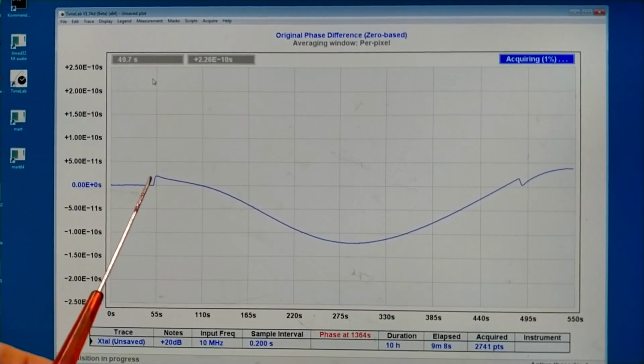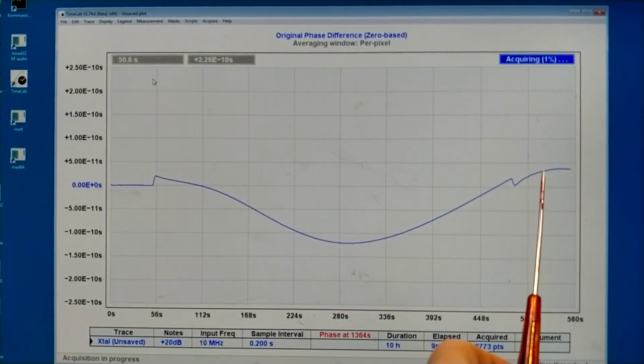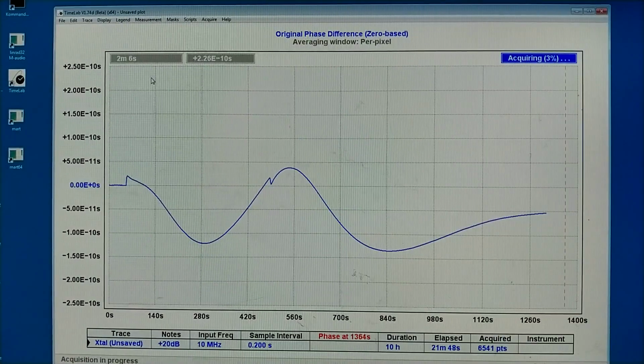At this point I turned it towards getting warmer, and here I have set it at some point where it might be close to correct, so I run it clockwise to close to the original. And now I can see on the current consumption it is cooling. Well, I forgot that the power is now 2 decibel higher than what I think is the optimum, so I reduced the power by 2 decibels.